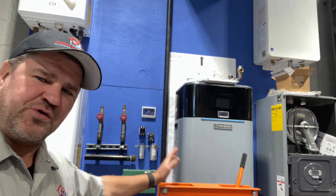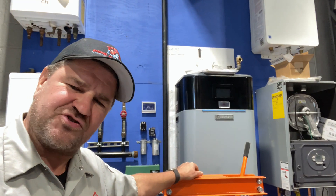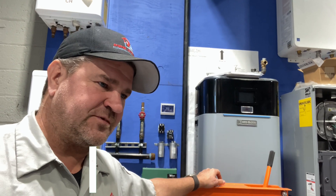Sometimes it's best to get the news directly from the horse's mouth. In this particular case I called Lars tech support, let myself be their eyes and ears in the field, explained what I saw, and let them make the determination. This thing has been neglected from day one — there's no putting it back together. It needs to be replaced. Can we repair it? Yes — we can replace the vent piping, make sure all connections are airtight, replace the heat exchanger — theoretically put a new engine in an 18-year-old car. Does that make any sense? The lesson learned: if you're going to invest in one of these machines, do not neglect annual service. 15 years old, it's shot, it's dead — it can't even breathe anymore. Cross-contamination and lack of maintenance.